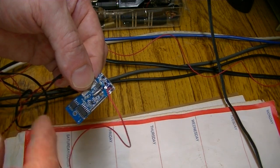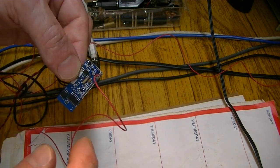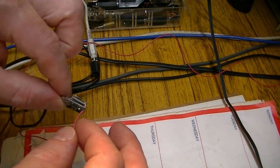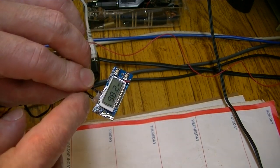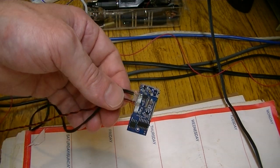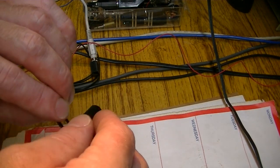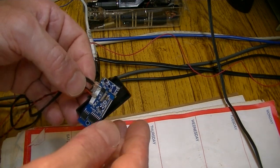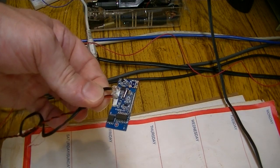I was able to pick this transmitter up, receive it downstairs quite clearly, but putting the extension wire on for the aerial gives you that extra range should you so desire. And I've also put some hot melt glue on the connections there just to give a bit of strain relief. I am going to fasten this back up in the box, the little case that it was all mounted in. So we'll then move on to mounting it either on the back or the inside of that god-awful Revo DAB radio. So catch you later.